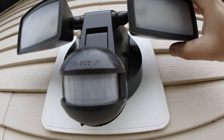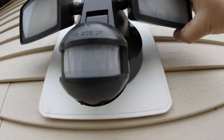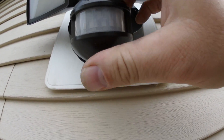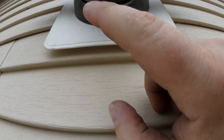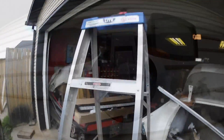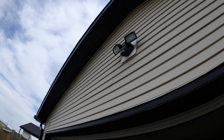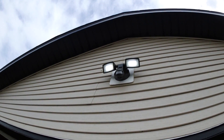We're all wired up now. You can point these lights wherever you wish — I'll point them more down and out. The ball joint rotates too, so I'm going to rotate that down. For settings, I'll set sensitivity and on-time to half and half for now. As always, use caution on the ladder. Let's hit the power and see if it works — and if you didn't have the power off, you'd be electrocuted by now. Winner winner chicken dinner, we're all lit up!